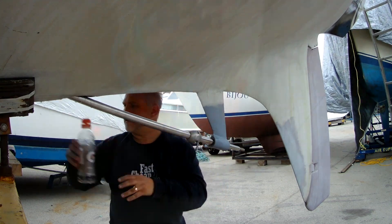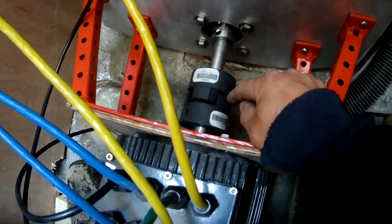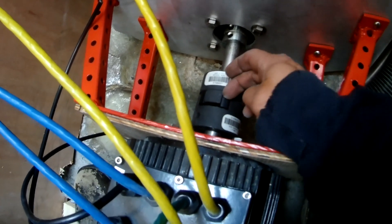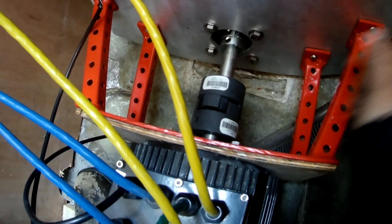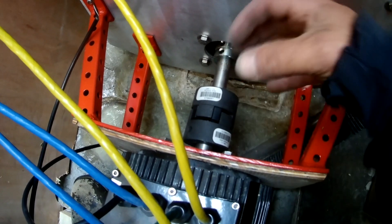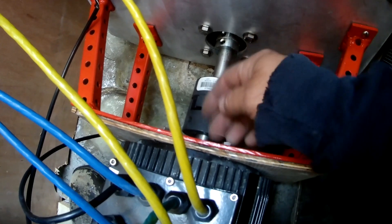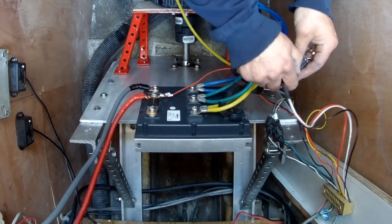I'm just moving up the cutlass joint. I ended up going with a flex coupler here - this one's called a jaw coupler. There are two halves: this half is bolted on the seven-eighths inch shaft and this coupler half is bolted to the one-inch shaft on the motor. This here is a spider rubber mount with a bit of a gap. Basically this neoprene spider insert allows there to be a little out-of-alignment rotation. This worked a lot better than the two couplers I welded together, because I have an ever-so-slightly out-of-alignment situation between the motor and the shaft.